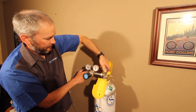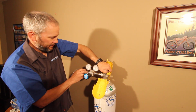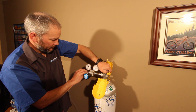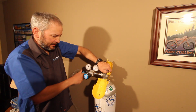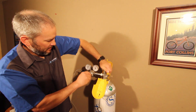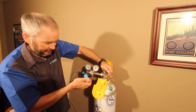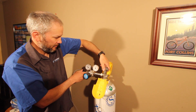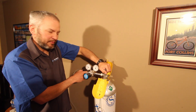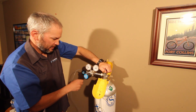Open our cylinder, close our cylinder, open our output. It's also not a bad idea to exercise the pressure regulator setting a few times. We're going to come back on and dial this back up to 30. I usually do that once or twice throughout this. With a vacuum pump, you can usually get this done in five to ten times. If you really want to be safe, go ahead and do this about ten times total with a couple of exercises on that.